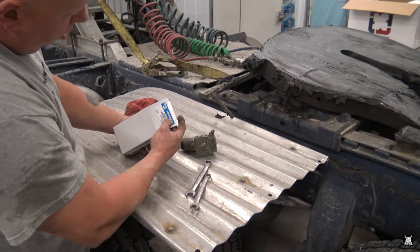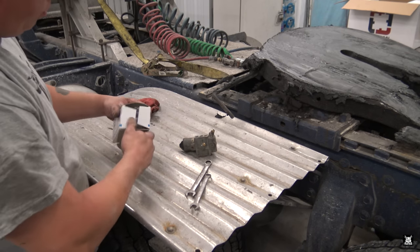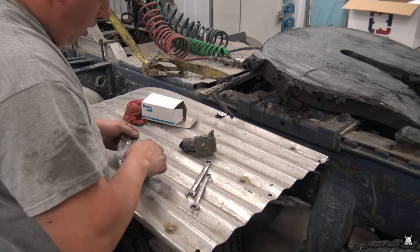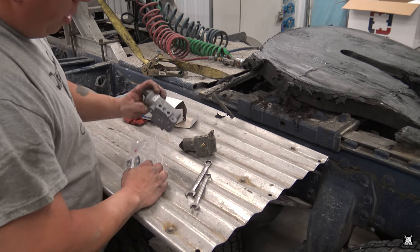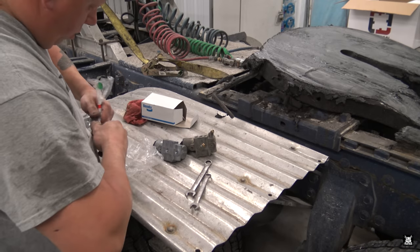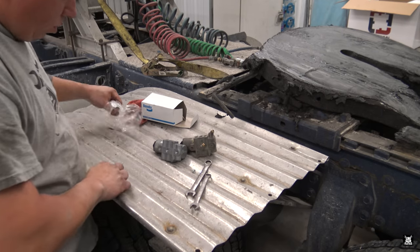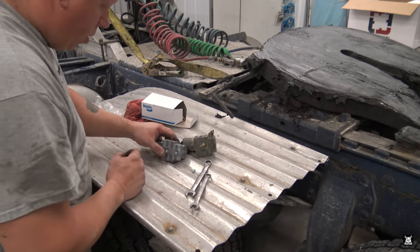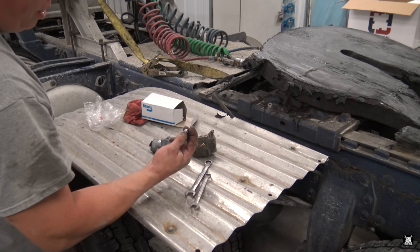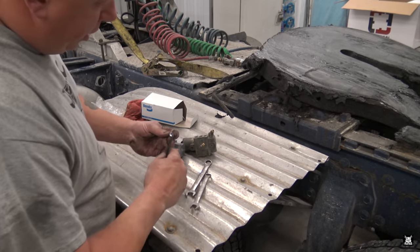You're gonna wanna try to do that basically identical with the new one. Let's unbox the new one. Part number on the new one is 275491N. Made by Bendix. There's our brand new governor. In the kit comes a brand new governor, a gasket, and four pipe plugs. Don't lose the gasket. What you need is an Allen wrench for these pipe plugs. Oh, and these even come with Teflon on the threads already. The pipe plugs are 3/16 Allen key.